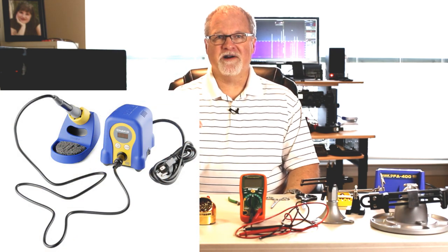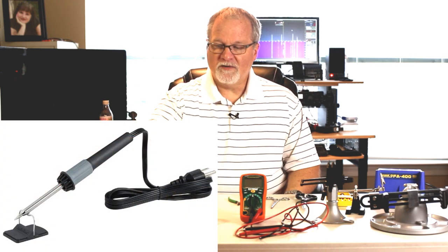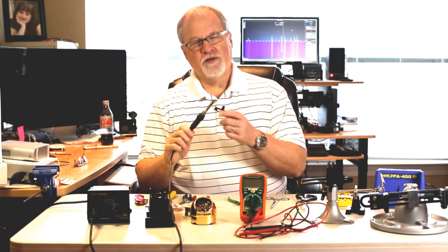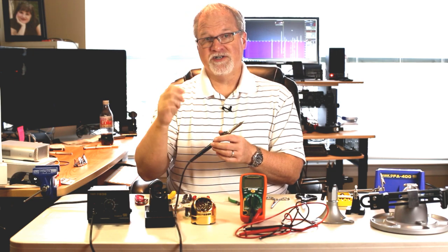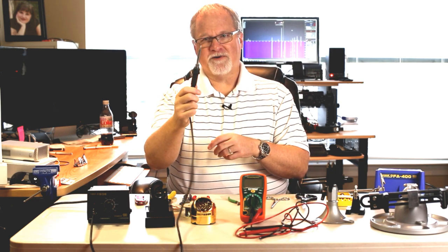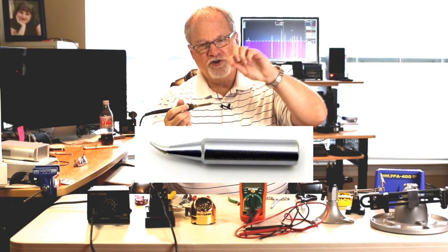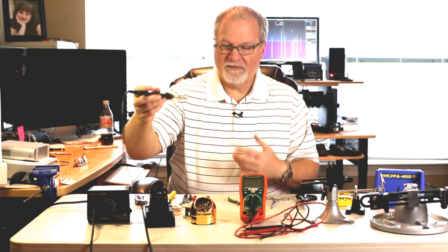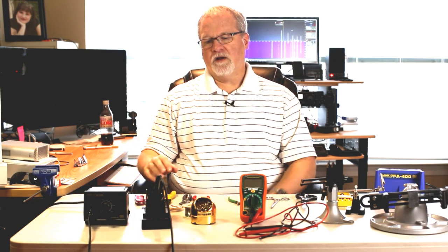First, a soldering station. This is different than just a little pencil soldering iron that doesn't cost very much. With a soldering station, you can turn the temperature up higher and maintain a constant temperature at whatever level you want. And most importantly to me, the tips are replaceable. A pencil soldering iron normally comes with a fairly large chisel tip, which is fine for soldering PL259s, but for working with circuit boards you really need a smaller tip. This tip I've got here has a little hook on it, which makes it easy to get into difficult places. A soldering station is a must-have in my opinion. Even though it costs a little more, it will last a long, long time.